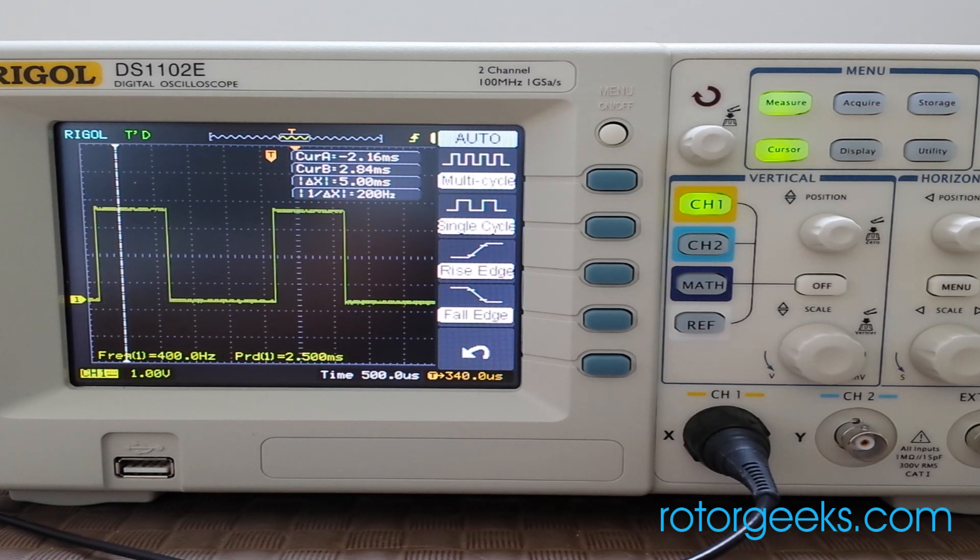One more time — we'll take it off, then power on. Notice that you're not hearing the second set of beeps coming out of the speed controller. That second set indicates that it's armed. What's happening is that the PWM signal is not getting there fast enough for the speed controller to detect it.